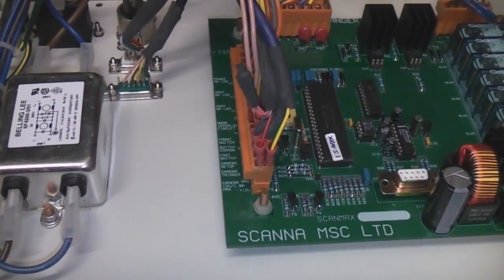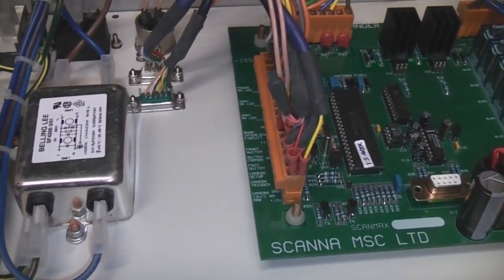Right, now the reason this thing uses a long exposure is to reduce the power of the X-ray source. But what I was expecting was maybe either a digital camera or an analog camera and some electronics to do the averaging. But in fact, there's no video processing electronics that you can see. Basically, the VGA connector just goes straight into the camera, as does the mouse connector. So I had a look online and found that this is a customizable camera with built-in processing electronics. You buy the camera and then you write your own software to run on the camera. So obviously what this is doing is that 10-second integration, whether it's either a long exposure or it may be taking multiple frames and averaging them.